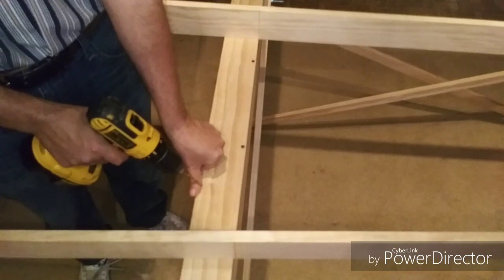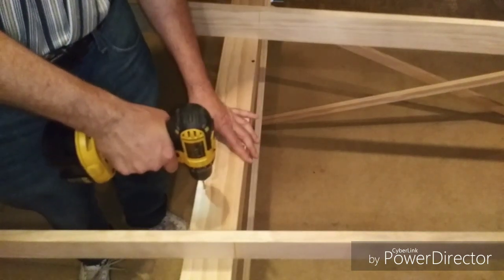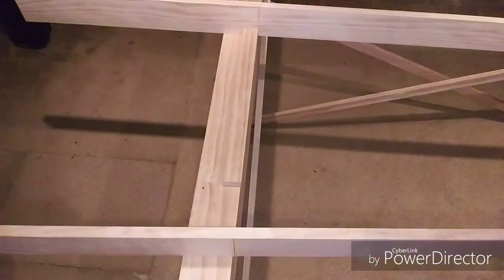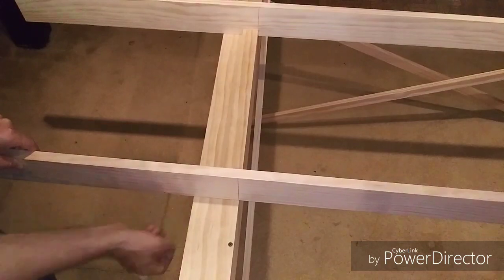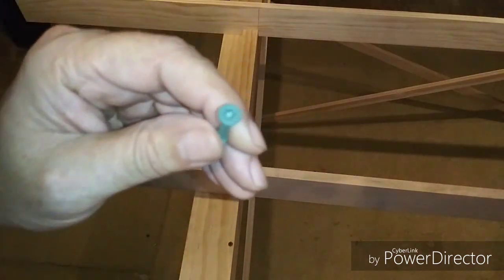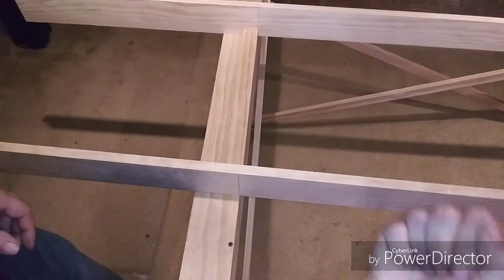At that point I'll take a drill — and of course, safety glasses — and come in about an inch from the edge, right in the middle of those two lines. Just very carefully drill a hole. I don't have to be too terribly neat about it. Then I'll take my stick and put it back into place, push my joist back into place, and run a screw up through that hole to bolt it down. The screws I'm using are Torx head deck screws. I highly recommend those — it makes it a lot easier to use your screw gun from underneath than trying to push up with a Phillips.